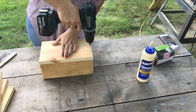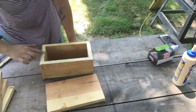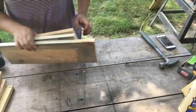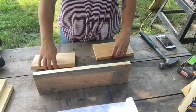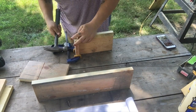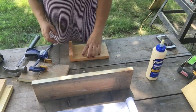Now let's do the same thing for the bottom. What you want to do is get two of the sides completely flush and square, and then nail the other two sides down, because if the bottom piece you cut is a square corner, that will square the box up. Drill some pilot holes and put the screws in. Alright, now let's start the bigger half. I laid out all my pieces again beforehand because some of the pieces in the front were very similar sizes and I didn't want to get them mixed up. So I just laid everything out first, then started putting everything together the same way — pilot hole, nail, glue — all the way around.